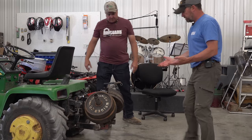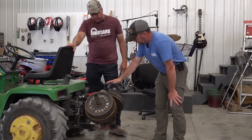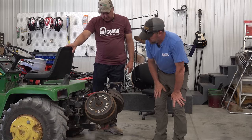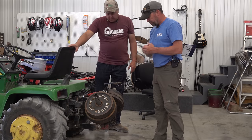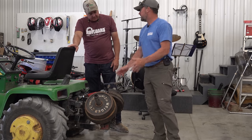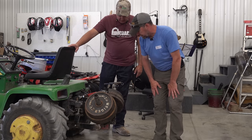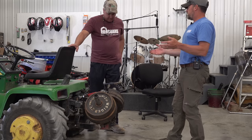This is my custom-built heavy hitch — a category zero three-point hitch. The 316 and 318 John Deere lawnmowers came with a category zero you could order as an option. All of my attachments have this 5/8 attachment pin — a 5/8 size rod with eyelets. I had a bunch of dumbbell weights that I wasn't using.